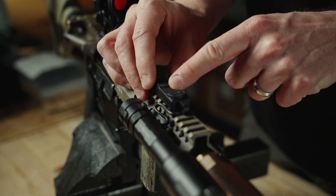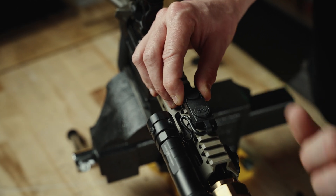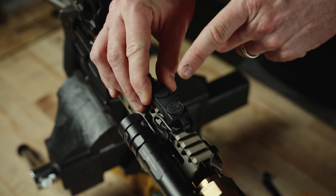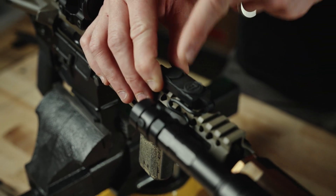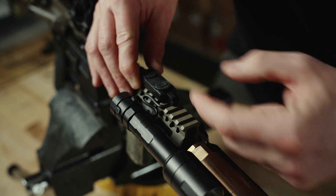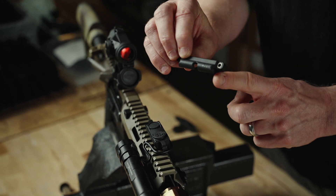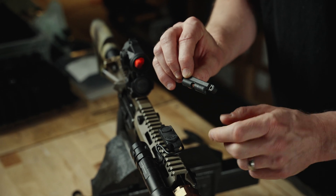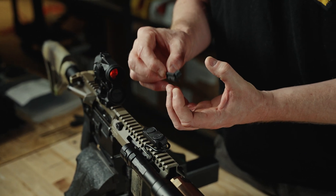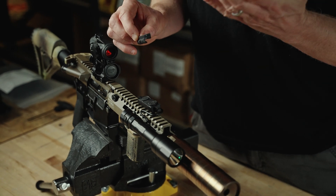I've got this one pre-positioned so you can see. This cable has some memory to it, so once you get it positioned it doesn't really want to move much — that actually makes setup a little bit easier. What I did here was exit the cable from the bottom, came out the left side, ran it forward through that channel, then turned it back. That's where I'm leveraging what we call the early exit feature — it allows us to turn the cable back and exit it out, basically consuming excess cable inside the finished switch assembly so there's just minimal excess.